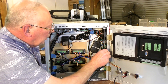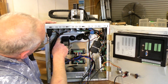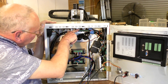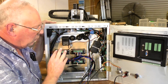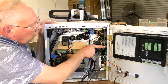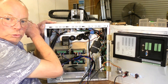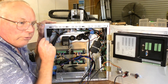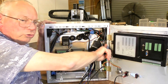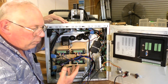This big fat lead here — that one is going to this large connector back up here that supplies the spindle. I've also got an earth lead, that green one, that is going to be supplying an earth to the actual CNC router itself. And of course this earth is going to the chassis of this metal box, so everything is earthed.